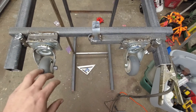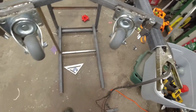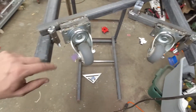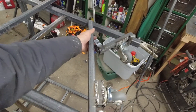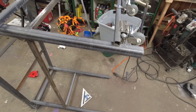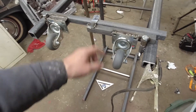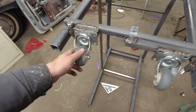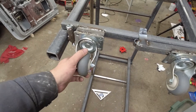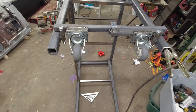The wheel assembly is basically built. I haven't put a latch on yet, but other than that it's essentially done. It works exactly as it should — this will be pushed up by the weight and drop the legs down onto the ground, and when I step on it, it'll push down. I welded the casters on — I know you're not supposed to weld casters, but I didn't want to figure out how to run bolts through in a way that wouldn't become a problem. They're also welded a bit off-center so they're not sticking out. I may need to add a reinforcing triangle piece on the other side, but I don't expect to use these that often. If it doesn't work, I'll rebuild it.